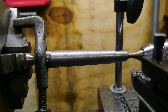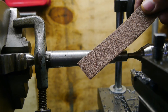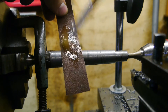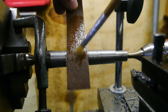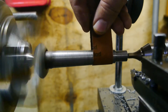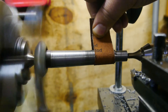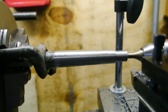I think I'll try polishing now. I'm getting ready to polish this — I have some 80 grit emery cloth and I'm going to put some oil on it. I find that if I put some oil on it, most of the swarf will stay on the paper. That's still pretty rough.